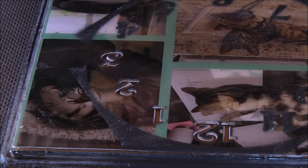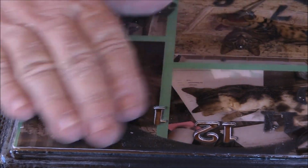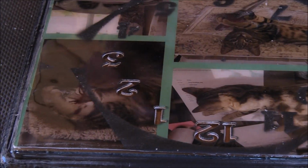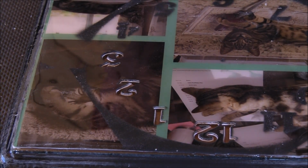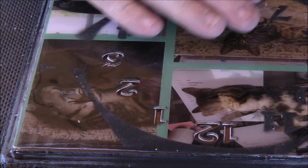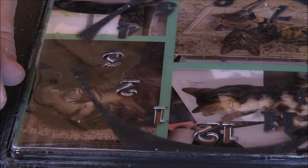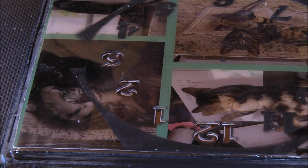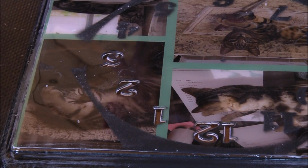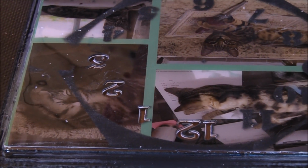Now, one thing that I have learned on cutting through this resin is, don't let it build up. As soon as you make a cut and that stuff builds up in there, get that blown out right away, because the more that you don't, the more that it will catch on the bottom side of your base plate. So it takes having an air hose right near you and blow that stuff out as you're cutting it. So anyway, I'm going to get the rest of those numbers cut.